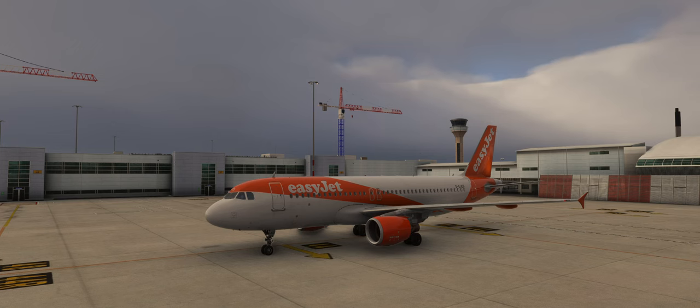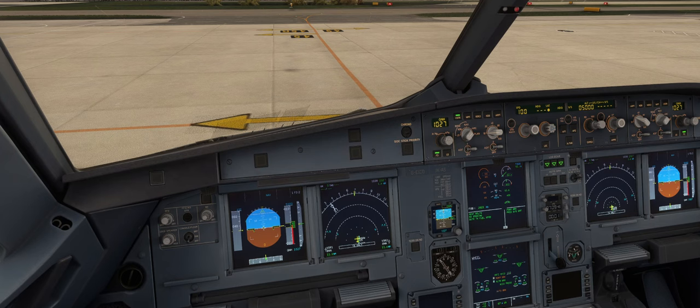Let's go into the cockpit and have a look at how we do that. First of all we'd want to obtain an ATC clearance to conduct this, as we have to use higher than idle thrust in order to generate enough bleed air from the supplying engine. So we'd let ATC know that we're conducting a cross bleed engine start and we need to use higher than idle power. Obviously we need to have a good check behind us and make sure we're not going to cause any problems with jet blast.